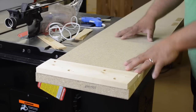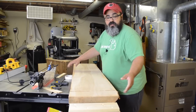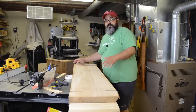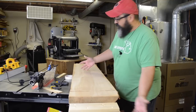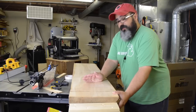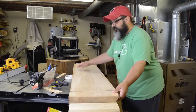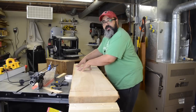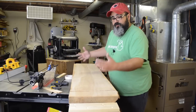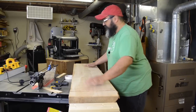That is literally all there is to it. Now let's get this board set on the sled. The first thing we need to do is shim the board, because we don't want any rocking. If we left it as-is, the rollers would push down and keep it flat under the rollers, but where there's a twist, that area becomes flat under the rollers — and once flipped over, it would still have that rocking. We want this face as true as possible.